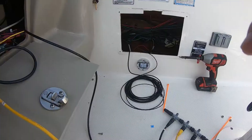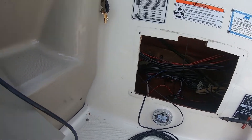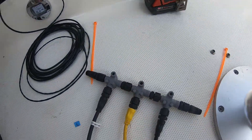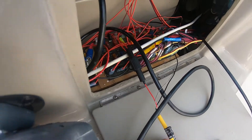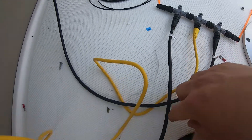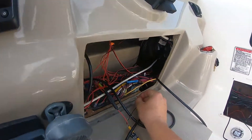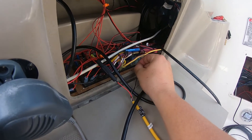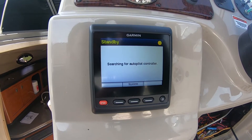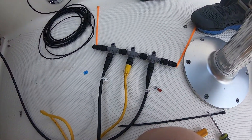From the CCU I ran the NMEA backbone cable, which I have plugged in at the backbone. This yellow wire is running power to the control panel, and this one is running to the actual Garmin unit. If I take this ground, put it here — look at that, it turns on! There we go. Now I just have to mount the backbone up underneath the dash somewhere out of the way.